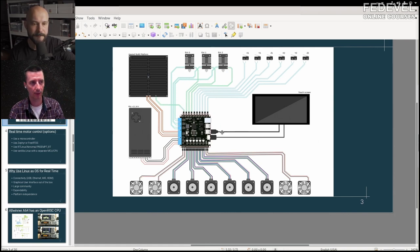The extruder heating element is about 40 watts — not that high. But the heated bed is usually a pretty high current draw. When using specific types of filament you may need to heat the bed to a specific temperature so that what you're printing sticks to it. Then once it cools down it will pop off.